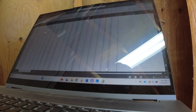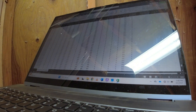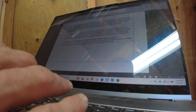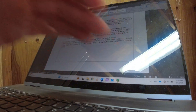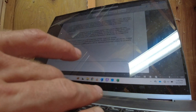It stays around 20 amps until 4:48 and 10 seconds - that's three minutes, which is insane. Then it drops to around 10 amps and bounces back and forth between 10 and 20 amps until 4:52 and 30 seconds. What could cause three minutes of 20-amp readings after an overload trip?